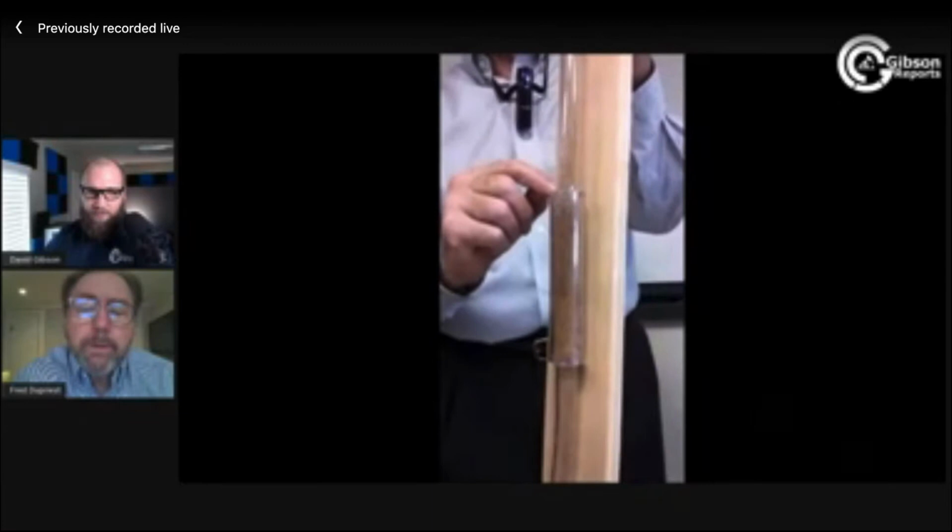So as it concentrates, you know, what you can see is it starts to kind of gurgle. There's so much cuttings, and I have power, so I can push through them. As I do that, I punch a small flow area through the middle of that mass. The velocity goes up right in the core, so that lets me lift pieces of the cuttings out. Stop. So it's gurgling up.